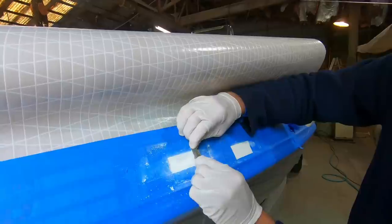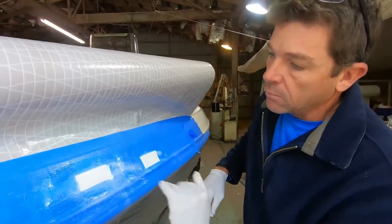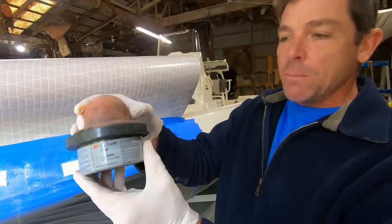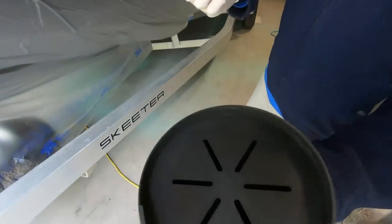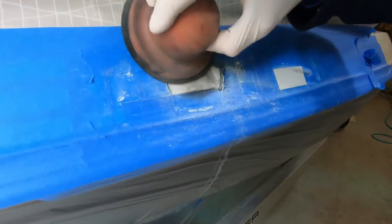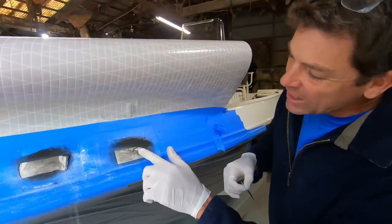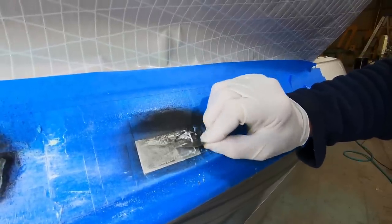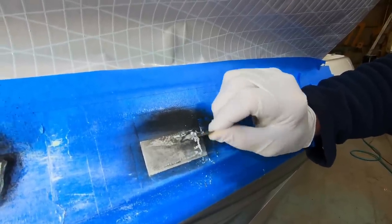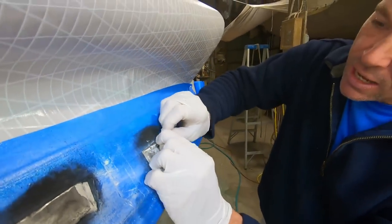This is why we overfilled a little bit — when we put three coats on, you want more gel coat than the bare minimum. 3M makes what's called a dry guide coat — it's got a little foam applicator pad with graphite powder. You can apply it to the surface and it'll show you where you need to be. You can see the highs and the lows — high, high, and a little low right there in the middle. We've got some little ridges on the second repair area too and we're just using the razor blade to draw down some of that excess.